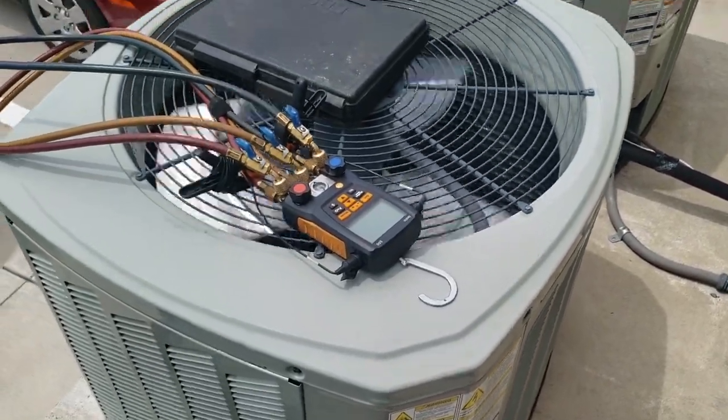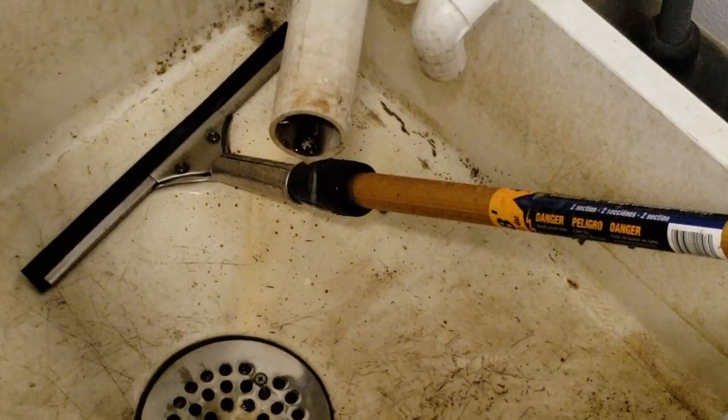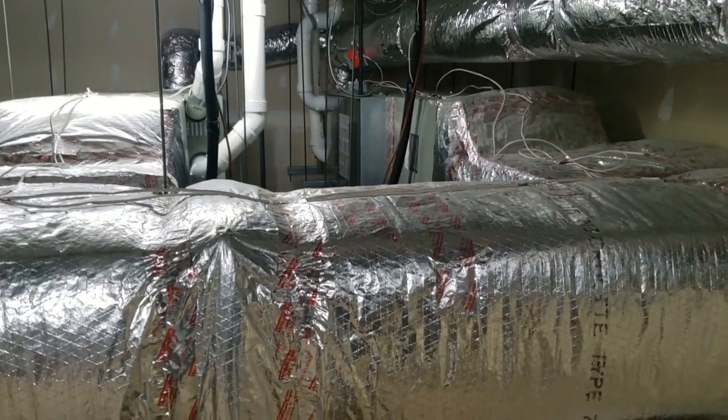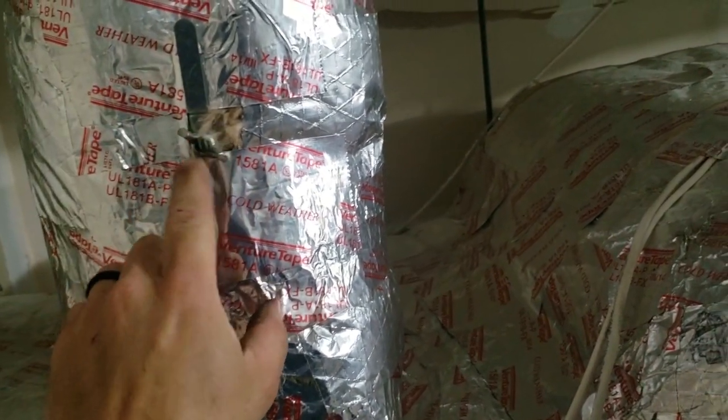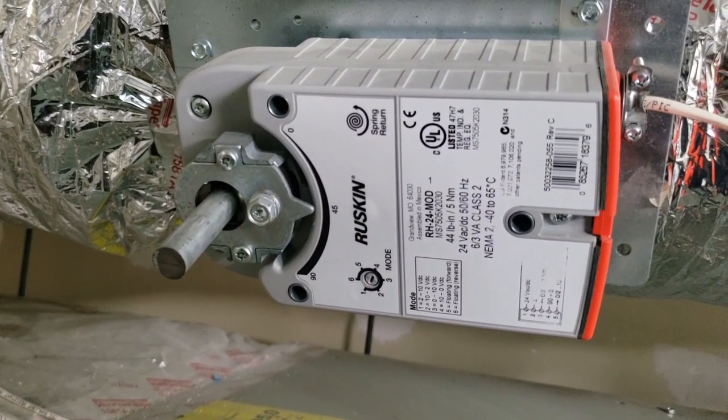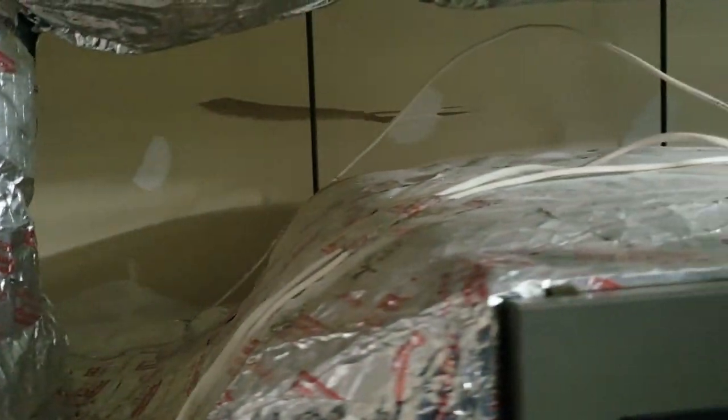We're definitely removing humidity from the air — it goes up and into the unit. I went ahead and checked the thermostats and made sure they can't be turned down any lower than 65 degrees. The way we run things here — in metal pipe, then insulated — obviously takes a lot more time and effort to run in hard pipe. We've got a makeup air opening here bringing in 100% outside air when it runs, which could be causing some issues. It's on a powered-open damper, so I'm going to limit it down a little bit to help.